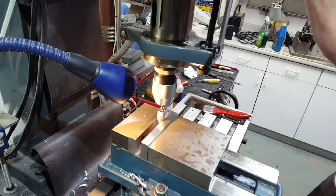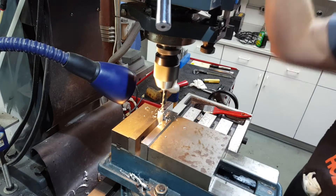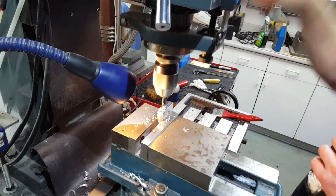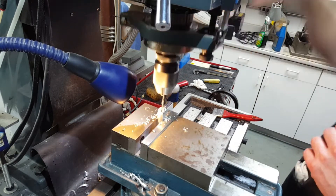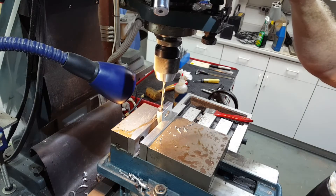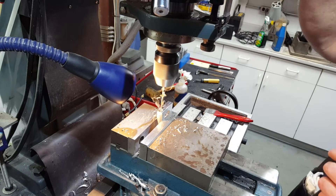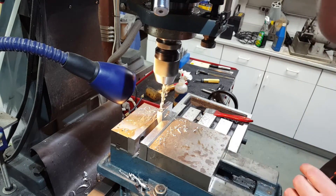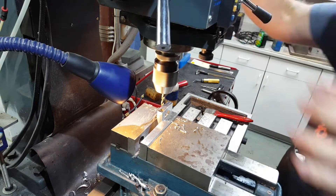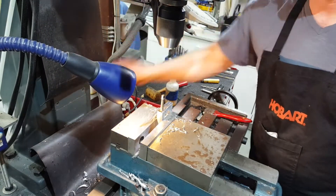After boring the hole to size, I flipped the clamp up on its edge and then drilled two holes on either side of the hole to use for my clamp bolts. This looks a lot like a bearing cap on the bottom of an engine block, and it's constructed in the same way. I just use socket head cap screws that are mounted flush with the edge of the face of the aluminum plate. It's not necessary to go this fancy, but this is my standard method for making any kind of split clamp — same size tools every time, which makes it real repeatable where I don't make mistakes.